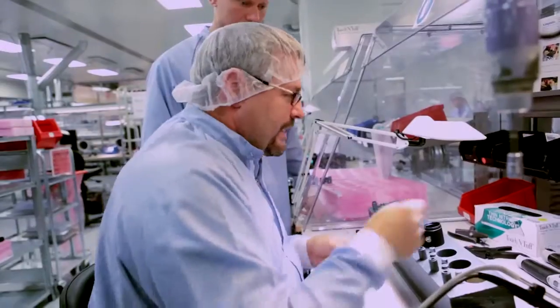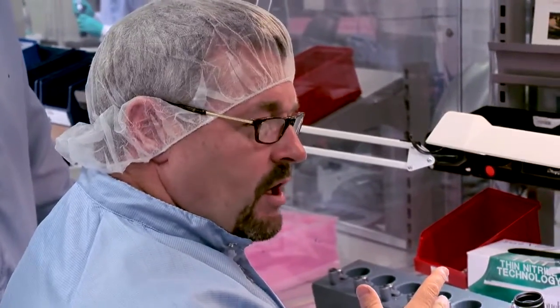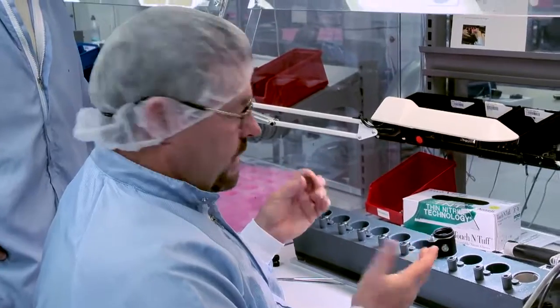All right. Is that the hardest part of assembling this whole thing? It's quite individual. Some think it's quite tricky, and some have no problem. So the most difficult thing about soldering is the very small holes, you have to be able to see it, and you have to get the wire just precisely right. Like he was saying, about 1 millimeter above. You don't want the insulation touching. You don't want the wire too far out because it might short out. So obviously that takes some skill to do. When I did it, it was complete luck.